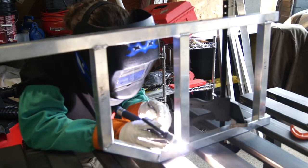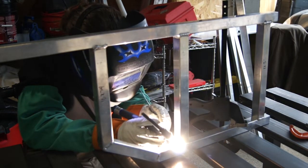I think overall it looks pretty good and it's really coming along. Actually it was a better result than I thought it was going to be. I was worried about the corner joints — the inside corner joints — but those actually went pretty well, because I had built my screwdriver holder before and that was a joint I had issues with. Once I got in there and figured out how to get the metal to flow in there and really toe it out, I think it came out really good. These were big joints, so I could essentially make them as large as I wanted to fill, and they ended up coming out pretty darn good.